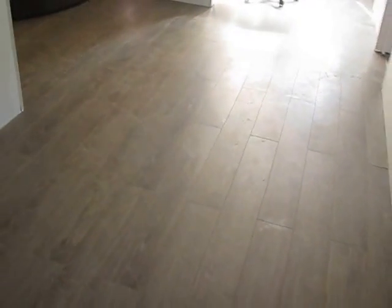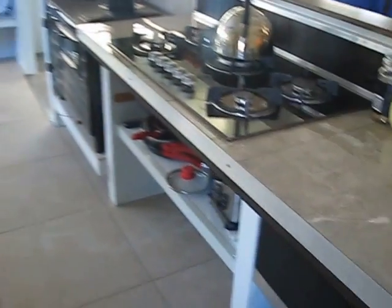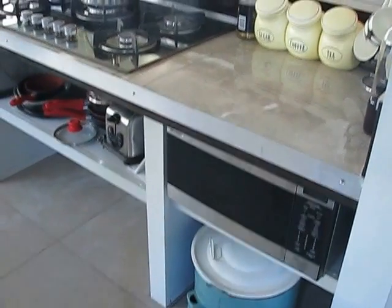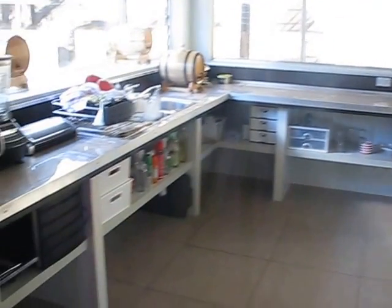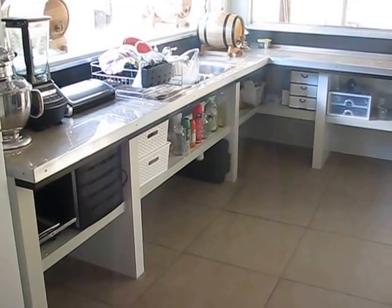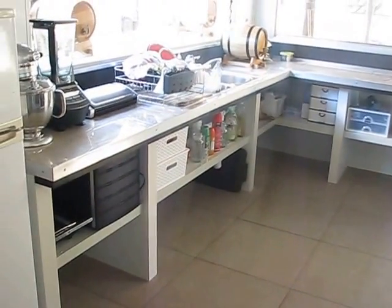And remember the floor, laminated floor, fairly orthodox. I use 12mm laminate sat straight on top of the SIPs. No preparation required. Tile floor in the kitchen, big 600 by 600 tiles. I did put AC sheet under that. Now this is even the kitchen, SIP panels. We've left it open deliberately because we're going to slowly fill this up with country style equipment and bits and pieces, but the basic carcass of even the kitchen is made out of SIP panels.